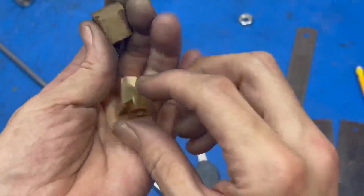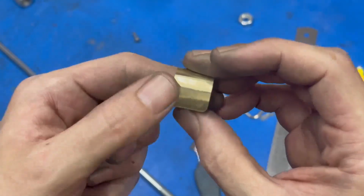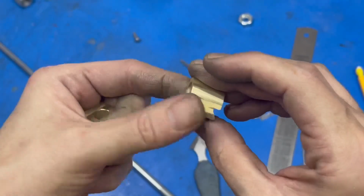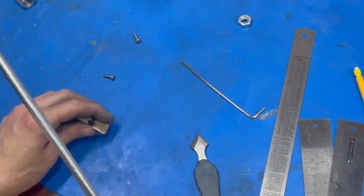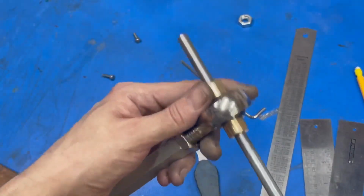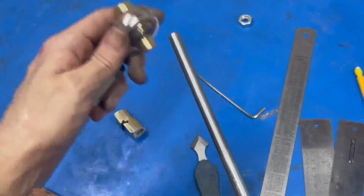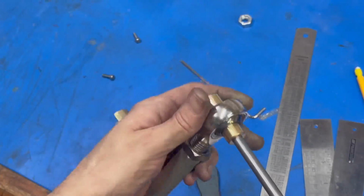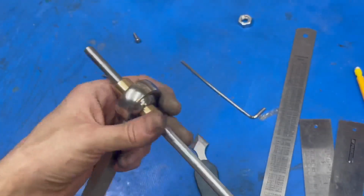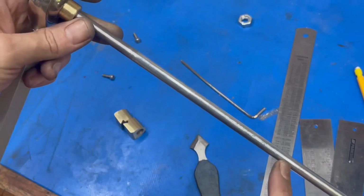Parts finished and they came out looking pretty cool, man, pretty sweet. Look, I think I'll give them a wee hand polish, hand sand to finish them off. And also, I'm thinking with the actual rod itself, I've created a taper where it comes in and sticks, but I think it's important for this to be able to run in it like that when you're doing it. So I think that we'll just put this back on the lathe and take this down a lot further.